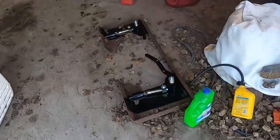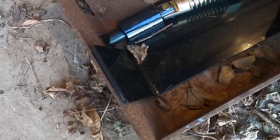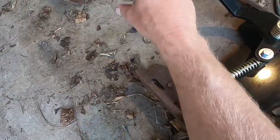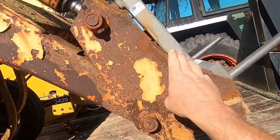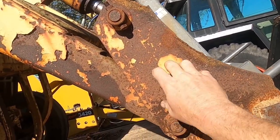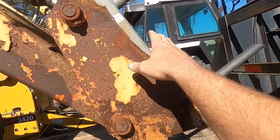How I'm gonna do it is: I got some tubing and I'm gonna weld some tubing here, up and down, then do that on both sides. I'm gonna run two pieces of tubing across, then come back out to the tractor. I'm gonna take some angle and run it from here to there to make that straight, and the reason I'm doing that is because I want more welding surface.